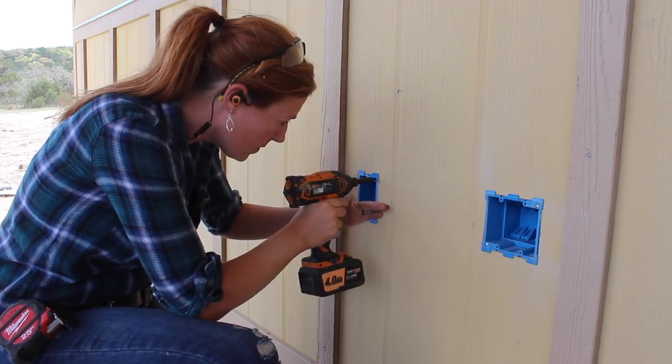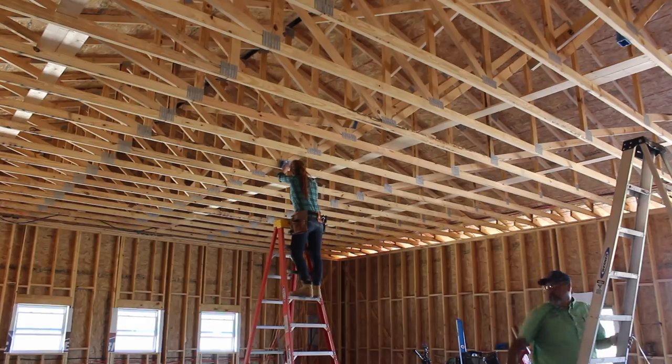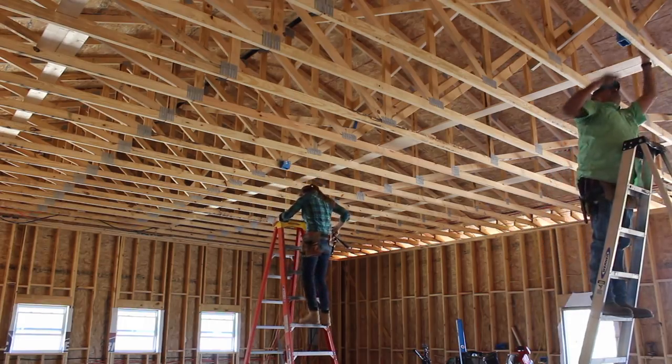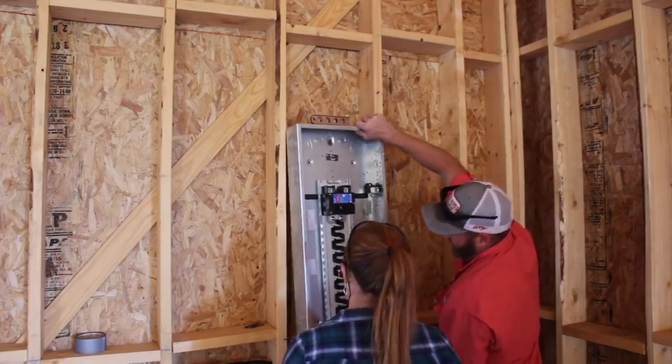While that stuff is not fun to cut through, I do think it's easier to install the siding whole and then make the cuts. The last thing we had to wire for is the lights. We went ahead and placed an outlet receptacle at every light so that I can not only plug the light fixture in but also have multiple options for plugging in cord reels. I'm going to have a three-way switch at every entry and exit point. All of the woodworking lights will be on one circuit and all of the metal shop lights on another. There will also be a wall sconce light outside every single man door, and I plan to leave those on all the time with a fixture that has a solar sensor to control when it comes on and off.